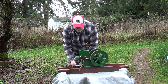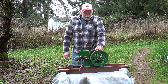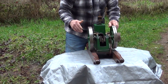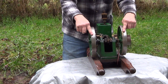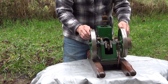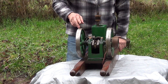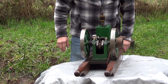This engine is just about as small as they made — about three-quarter horsepower — and all the mechanism is out in the open. The connecting rod is here, main bearings are here, and you get your flywheels. You'll notice the flywheels are fairly heavy to continue it through momentum. There's a governor down in here which you won't be able to see, but when we come back and do a full overview we'll go into a detailed explanation of how they work.